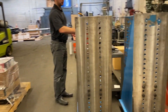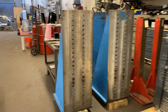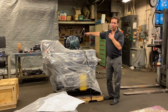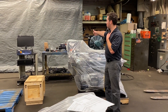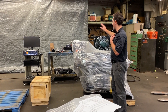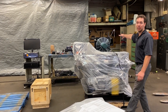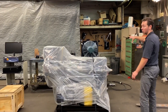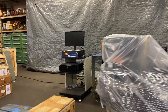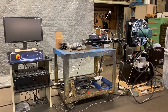We have some 90-degree bed plates and more pumps getting reconditioned. This setup is going over to local Oakland University — our M3500 controller along with an MTS actuator and hydraulic power supply. We retrofitted it with an air-cooled heat exchanger instead of water-cooled because it's going to a place where water was not available. It's all getting set up for reconditioning, calibration, and controls.